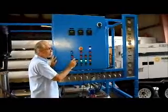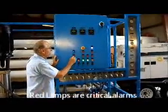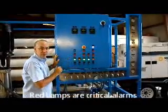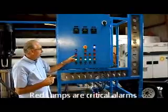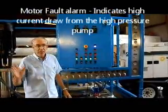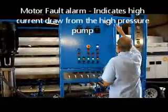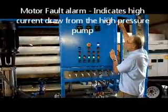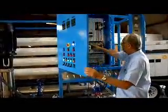The alarms of note are the red lamps. These are all critical alarms, and if these alarms occur, the system will stop. The first one is the RO pump overload. For some reason, this high-pressure pump draws too many amps, and the contactors and the overload inside, as we already discussed, trips.